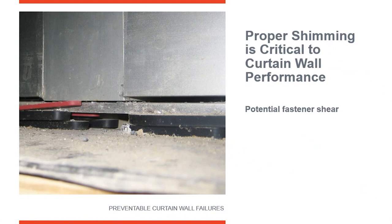The fasteners holding the anchor down are designed to work in compression, but with the anchor shimmed up, they're having to work in shear and compression. That means the 1,600 pounds of wind reaction is going through the mullion to the anchor and through the bolts to the surrounding condition. You're putting all the pressure on that elevation being supported in shear by the fasteners, which are not designed to work that way.